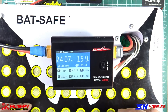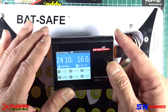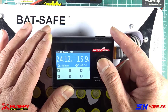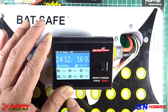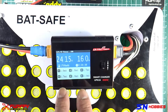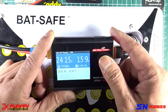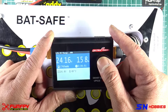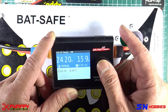We'll let it run and see if it holds 16 amps or close to it until the charge finishes — it will trickle down as it approaches 4.2V. While charging, you can check internal resistance by scrolling the wheel downward. It gives you IR readings per cell. If you want accurate IR per pack, charge one at a time so the numbers reflect only that pack. Scrolling further gives you temperature and input voltage. Scroll back up to return to the main view.